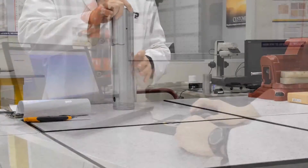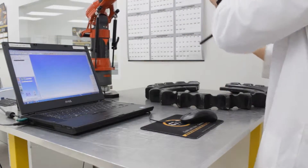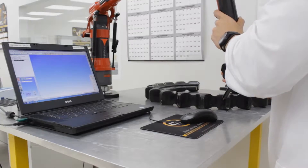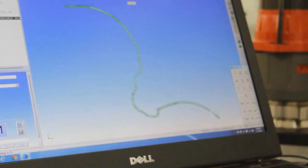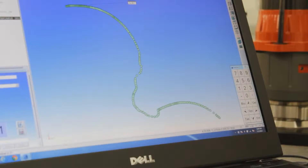After the visual inspection, with the help of a Romer CMM, or Coordinate Measuring Machine, articulated arm, we accurately check the profile and angle of each and every tooth. We check the thickness and profile of the sprocket. We check the location, as well as the inside and outside diameters of each hole.